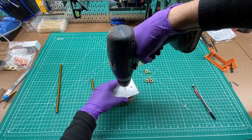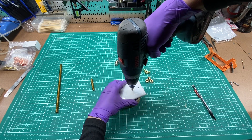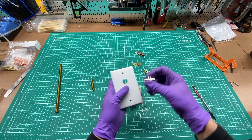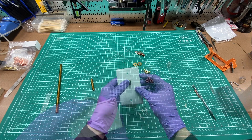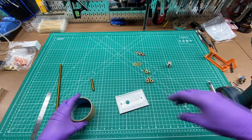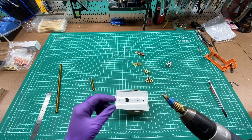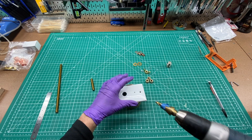I'm going to start off by drilling a small pilot hole, then flip this over and drill through the front with my stepped bit. Now for the equipment ground, I'll do the same thing — using my stepped bit with my tape adjusted to three-eighths, I'll drill through the front.